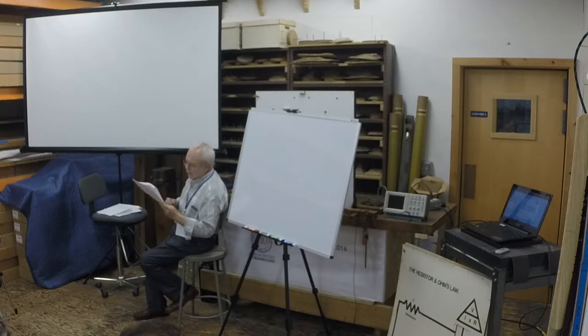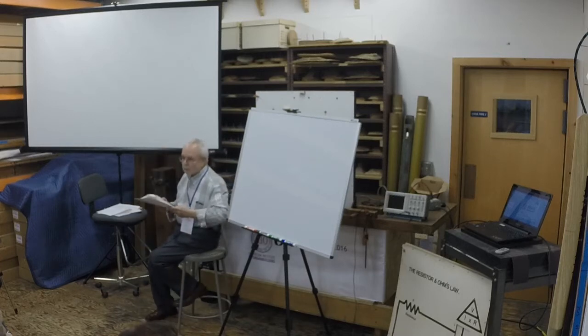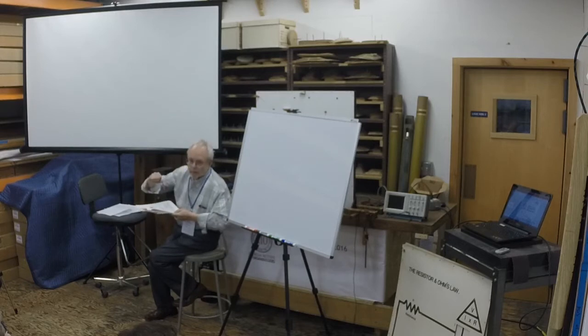Where to connect the positive cables? Linking the 2 power supplies together with a short but thick wire is okay if either the 2 units are true current limiting types, like modern switching power supplies, which is the one that's pictured here. Each will contribute what it has to and not be affected by its neighbor. Or the 2 have output voltage tracking, such as the newer type Astrons that have a red binding post on the back panel, and it says to link them from one to another. That just lets the voltage regulators in each Astron talk to each other, but it's not foolproof.